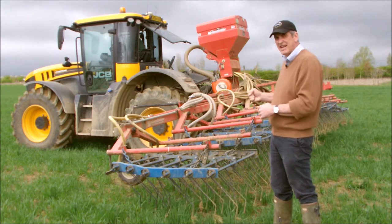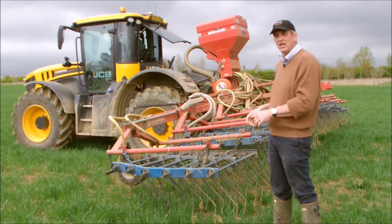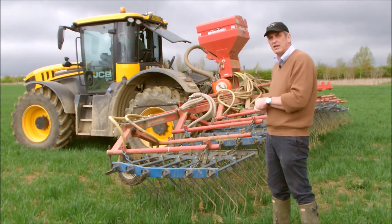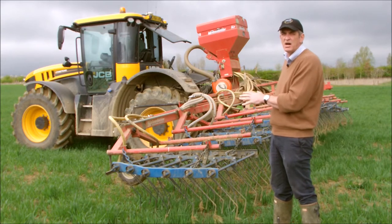You can set the density — or the agitation — of the machine. On this first pass I really want to see it stirring that bit of topsoil, then later on as your plant grows you can ease off a little bit. But as I say, about once a fortnight this will get harrow combed and this is its first pass.